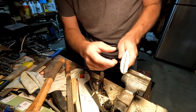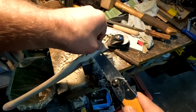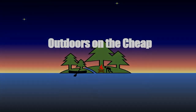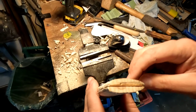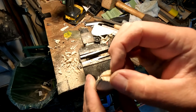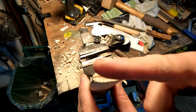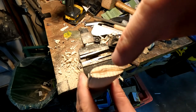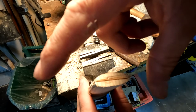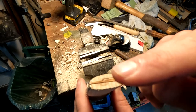I'm not hanging this with metal wedges, I just have wooden wedges, so when you use wooden wedges you have to do this a little bit differently. When you put wedges in an axe head, remember the top of the axe head is wider than the bottom, so basically you're making the top of the handle wider than the bottom so that won't come off. Normally you put one wedge the length of this and then a metal wedge in perpendicular to push the handle from front to back — one wedge pushing out this way and then the metal wedge pushing it out that way.